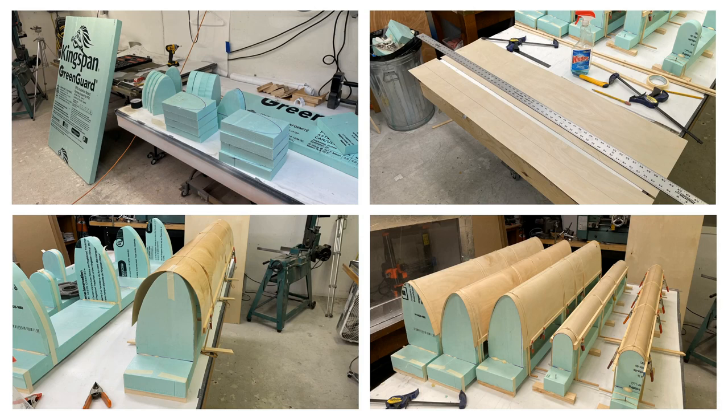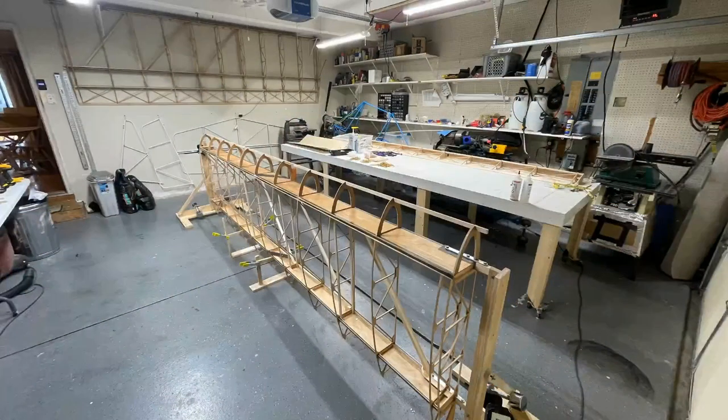I had to figure out how to bend this plywood without the disasters others reported. I went to the hardware store and bought some foam — this is a bit of a recap since I've done bending plywood videos before. I mixed water, Windex, and alcohol, soaked the wood, and it worked perfectly. No fracturing or splitting at all.